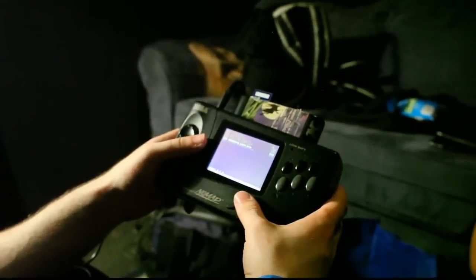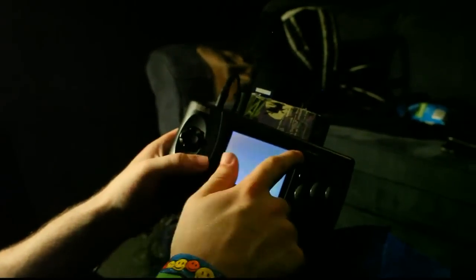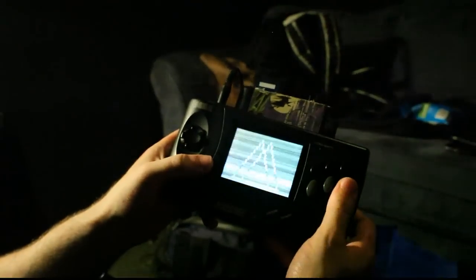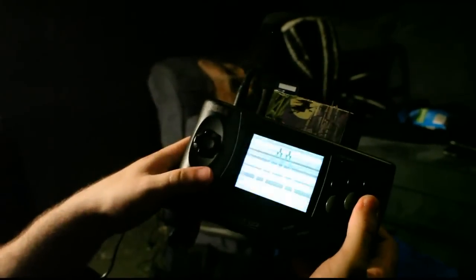The output is for me, but I wouldn't like playing it. So I'll jump over to another one — I have this Monodeer logo. What I'm basically doing is the TV draws left to right all the way through. There's a thing called the horizontal blank interrupt — when it gets to the left and it's about to draw that scan line, I can insert some code in there. Here I'm changing the background color, and here I'm changing it to the current palette — so here it's going black and white, here it's going to the current palette, and here's a glitch where I'm scrolling on every single scan line, and you get this kind of neat effect. I did this by accident — I'm like, oh, that looks kind of cool, I'm gonna keep it.